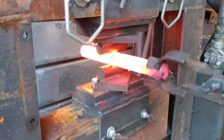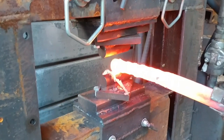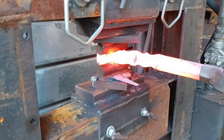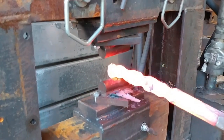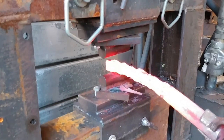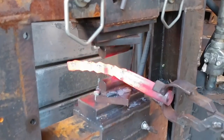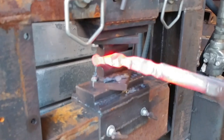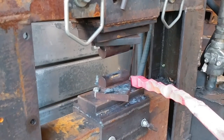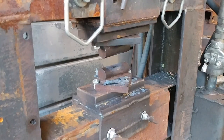In the press I have some one inch fullering dies. The press does need a little bit of work — I need to make my dies a little stronger. When I created this press it actually started as a completely different type of press, and then I had to convert it into an H-frame press versus a C-frame press. I chose the wrong material to build it with — I-beams — so there's a lot of issues going on with this press. Most likely when I'm done using it and redesign another press, I'll probably just scrap this one. It was a good learning experience — a very dangerous learning experience, as presses are dealing with tons of pressure and you have to be real careful. And there was the result of that.